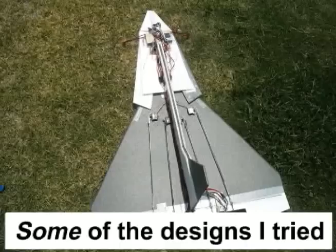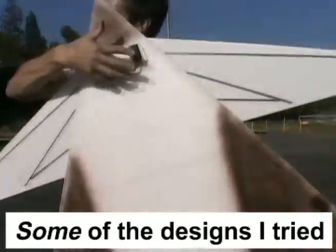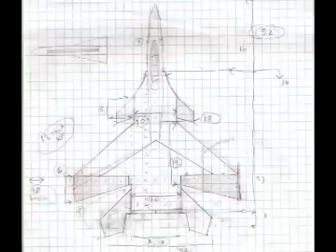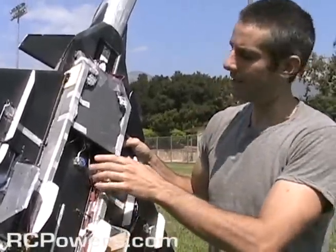Stage 1 of this project was finding the right dimensions and hardware as far as the wing area, the aileron configuration, as far as the angles and the proportions and the canards, and basically finding all of the hardware needed to have it physically be able to come up and stand like that, thrust vectoring and all that. Now that took a long time.